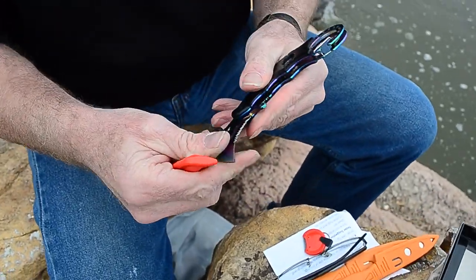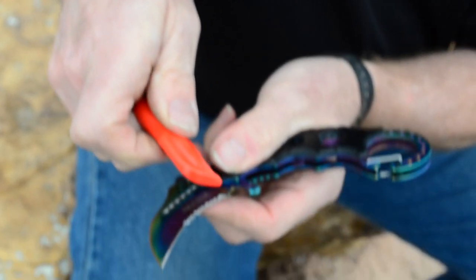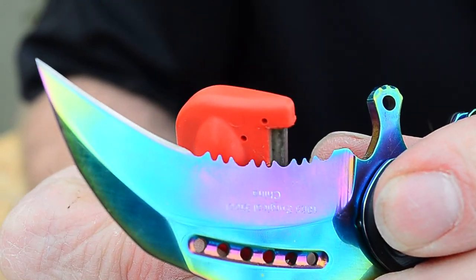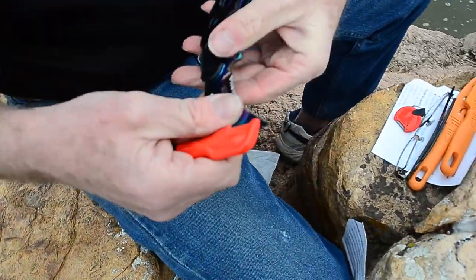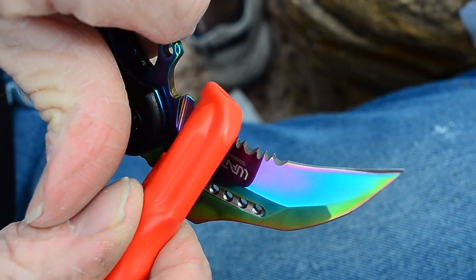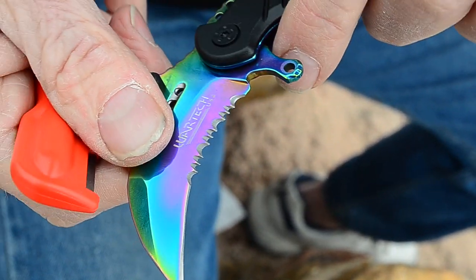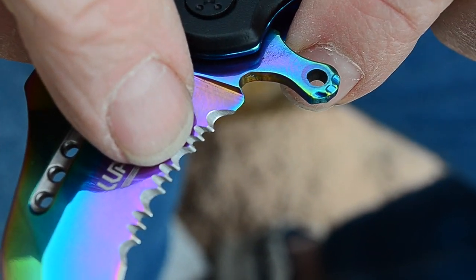Let's get right into sharpening the serrated edge blade. That 90-degree corner is what I'm going to put right down in the blade. I'll tip it over so you can see how it actually follows the contour of the grind perfectly. Then I'll do the little ones and then the round one. This is the only tool you'll find that actually goes down through the round hole and works perfectly — what I call following the contour of the blade. These are really awkward to sharpen. We make a pivot out of my thumbs and do: set it down left, slide it right. We look for the shine on the blade — if it shines all the way across that little surface area, that means we matched it.